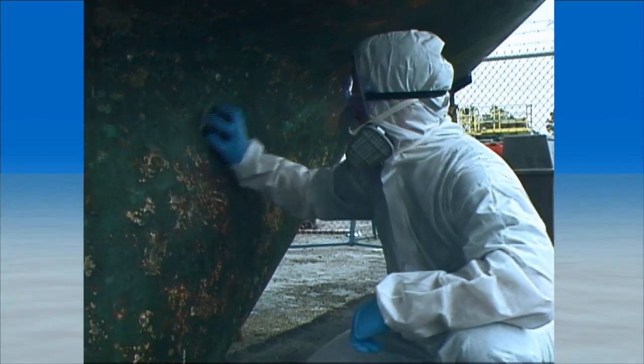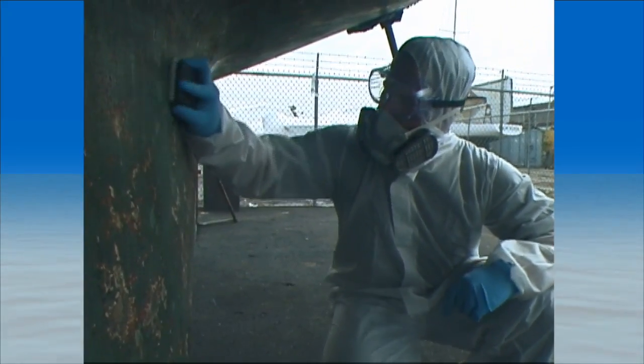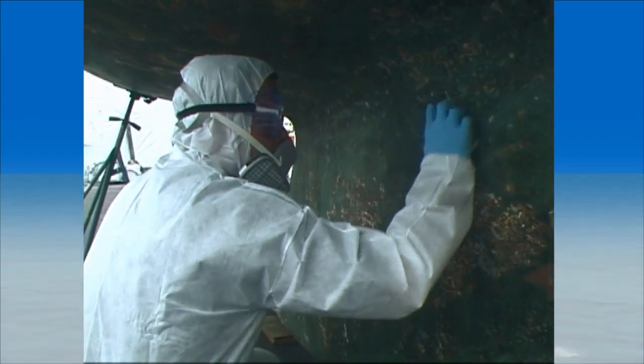Incidentally, if you haul your boat and discover blisters, a handy technique is to scuff sand the blistered areas to remove the bottom paint that's on top of each blister. That will identify their location so you can grind down to the solid fiberglass laminate and remove all of the blistered gel coat. This will also make the hull dry out faster.